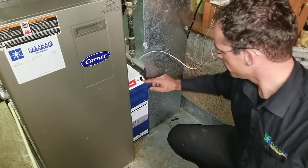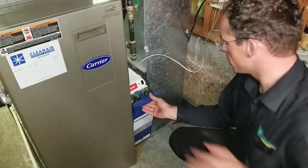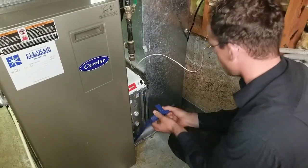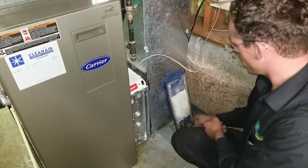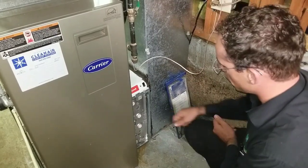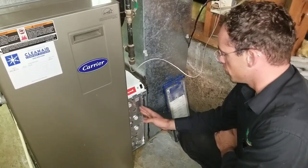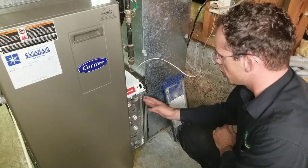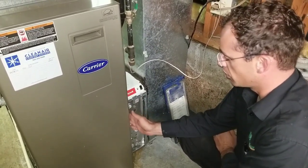You turn off the power to it. On this door — sometimes it's a little hard to pull — just jerk on it, then lift out from the bottom. This can be vacuumed and brushed off. Most of these electronic air cleaners will have either two cells and two pre-filters, or they may have an additional post-filter on the other side.